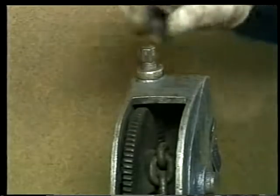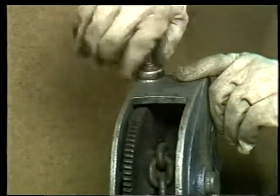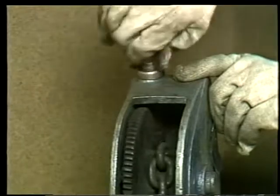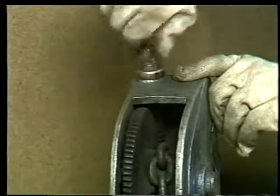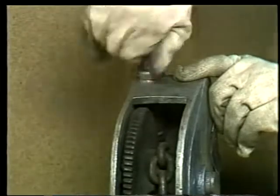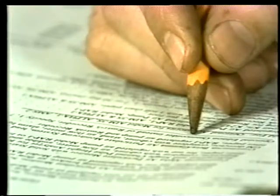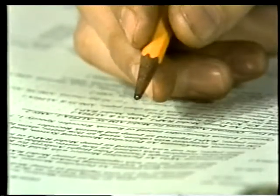The last thing to check is the operation of the sheave. Make sure it turns easily in both directions. Although some load levelers are pre-lubricated with sealed bearings, others have to be lubricated regularly. Check the manufacturer's recommendations and keep your load leveler lubricated properly.